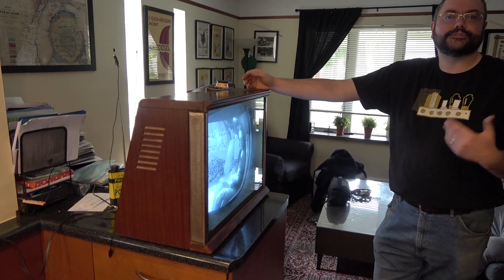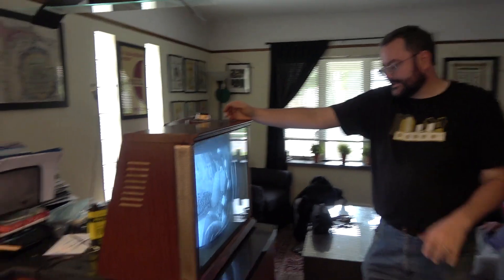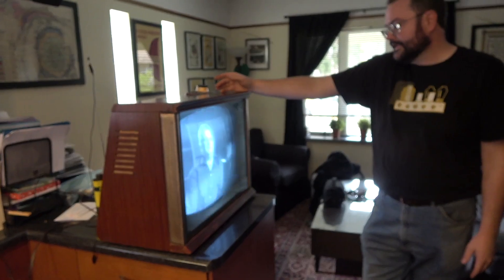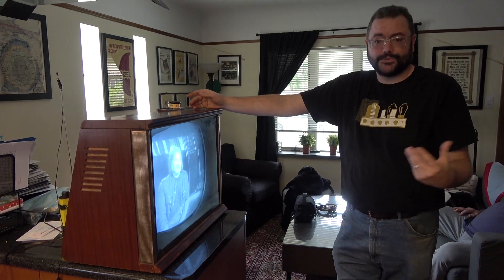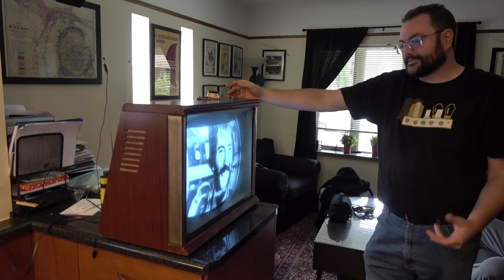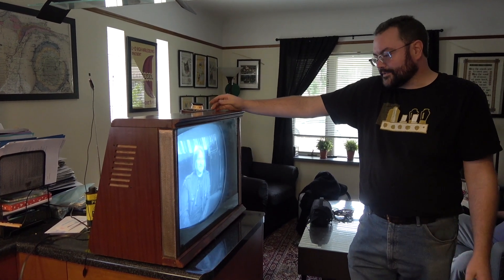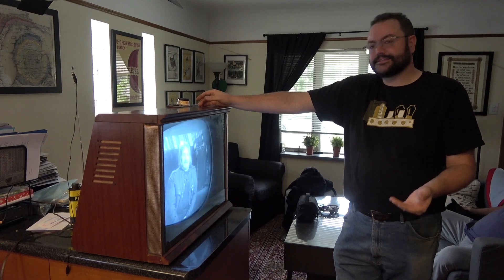The feet were missing off the cabinet, so we put new feet on it. I got the tuner mounted, CRT installed, and made sure the chassis mounting was secure and everything. Then going through the electronic restoration: the sweep board had a crack in it, so there were three or four traces that had to be mended. The usual recapping, going through and checking resistors, things like that. Then getting it together and realizing that even though the flyback rang well on the high-voltage side, one of the lower-end windings was open, so I wasn't getting any high voltage.